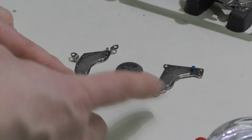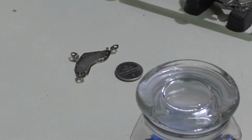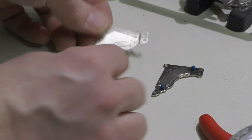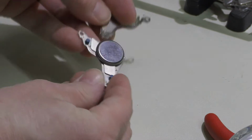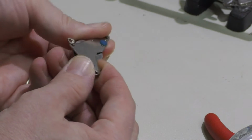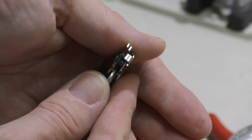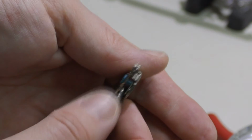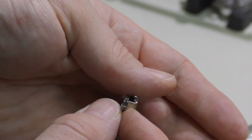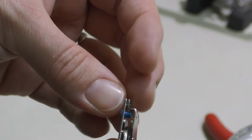They're 3 volts. These LEDs that are in this container here will run at 3 volts, so I think that's a win-win. My idea was, we could connect the battery directly to this magnet, obviously, and then they'll connect together. Now you have to be careful because you don't want it to short, but if you do it quickly enough, we can get it where they are sandwiched together, but they're not actually making contact because the battery is a little bit thicker. So you can attach an LED directly, the leads right to here, and maybe another one over here where they come down together.